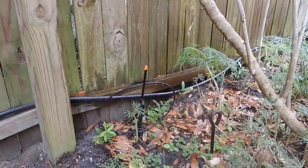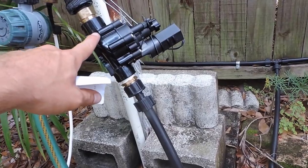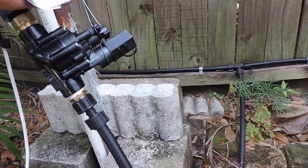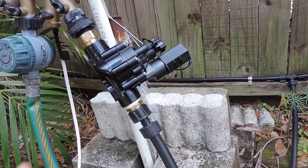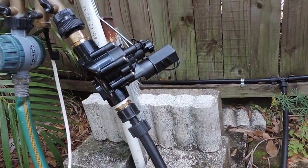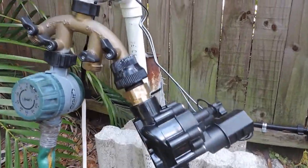I'm using a micro-irrigation system with little tiny sprinklers. Turning this on and off — these use 24 volts AC. When activated, that's what turns it on, pulls the solenoid in, and when there's no power to it, it's off. This wire, which I'm going to bury, runs into my workshop.